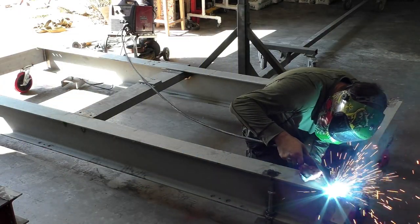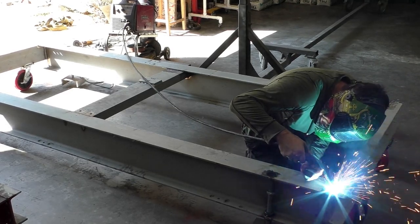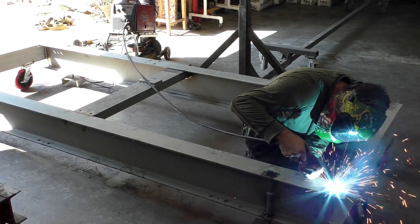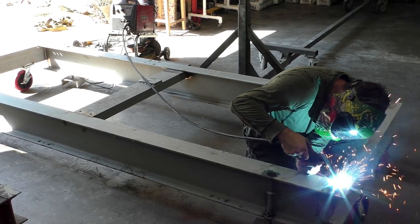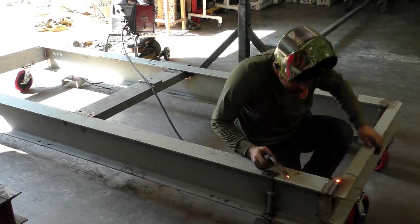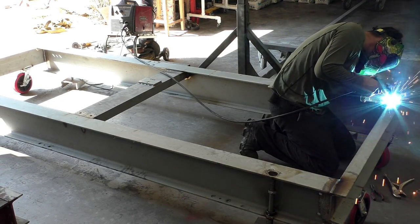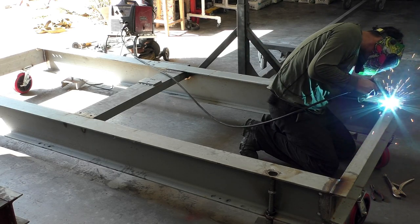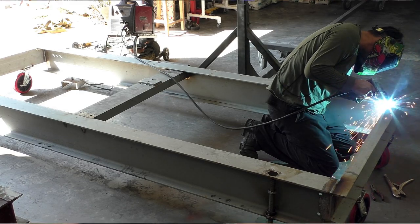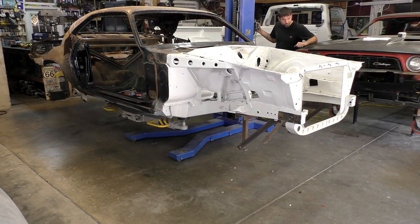Rolling it back in the garage. Now you can see we started with the grinding relief cuts from earlier - we're going to weld across the top of them. The good thing about putting those cuts in is the welds won't stick up that much. The top doesn't have to be perfectly laser straight. You can also put plates on top to make them even more durable and get a flat playing surface, but the cost goes up even higher then.